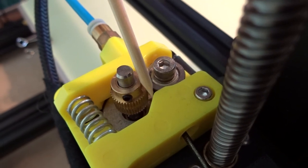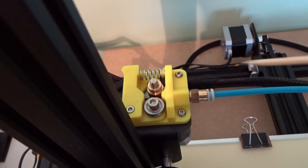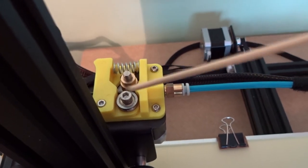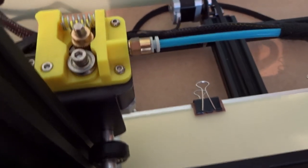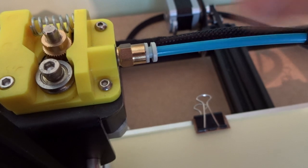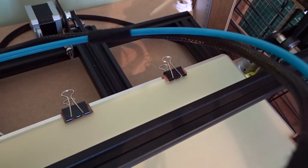This is the extruder — it has an extruder cog that turns against a bearing, with the filament going through the middle. Pressure from the tension on a spring moves the filament in and out. You're looking at 0.1mm resolution in adjustment; the actual stepper motor resolution is 0.04mm, so it's very precise. These are the Bowden clips — not a great design. They hold the Bowden tube in and guide the filament through. This is the blue Bowden tube — this is a Bowden feed printer.